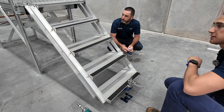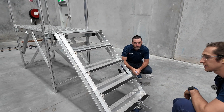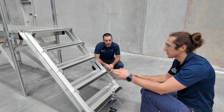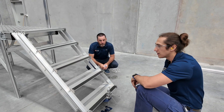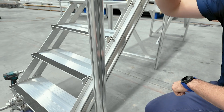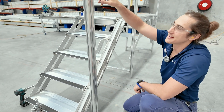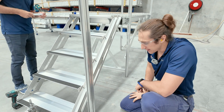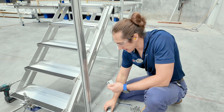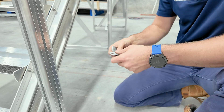All spacings will be the same the whole way up because the holes were pre-drilled by SafetyLink in the side stringers. Now we lock the staircase in place by putting the support posts on the front and tightening all the treads. The support post holds the stairs up at the front and also takes the handrail at the top. It's held in place in the staircase with two support brackets on each side — bracket D and bracket H.